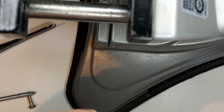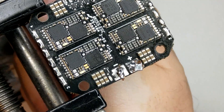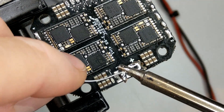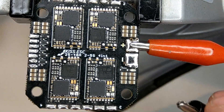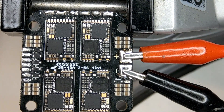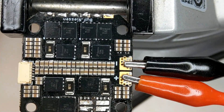Because we are talking about a lot of amps, this ESC unfortunately is dead. I will now take the one that has good caps, where the pads look decent, but something is bothering me — the mess on the power pads. Let's hook it up and see how it behaves when we power it up. Something is fishy — something is releasing some magic smoke.